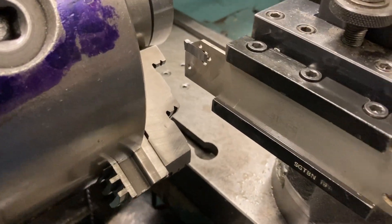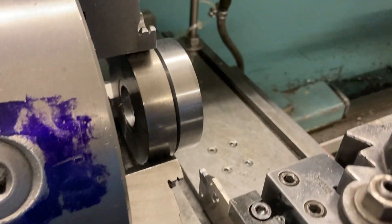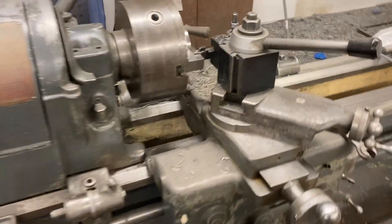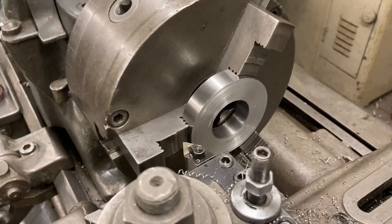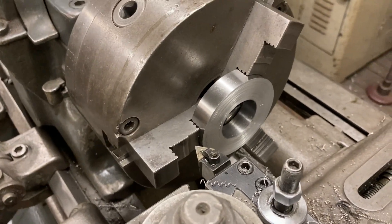I'll stick that blade out a little more. I don't like sticking it out more than I need to, but I have to push it out a little further to cut this guy off right here. After I part them off, they're about 30 thousandths long, give or take a little bit. Then I bring them over to the trusty old South Bend here — the old flat belt South Bend lathe. This way I can keep the other ones going in that lathe.